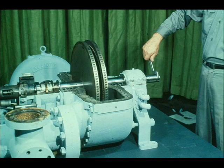It's considered good practice to check the shaft at this point, to see if it is binding in any way due to improper bearing installation. This may be done by turning the shaft manually, as the workman is now doing.